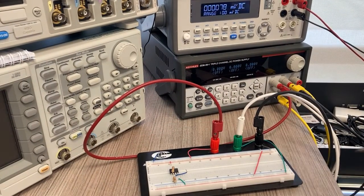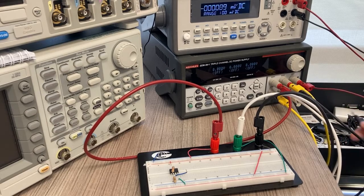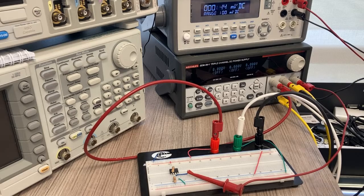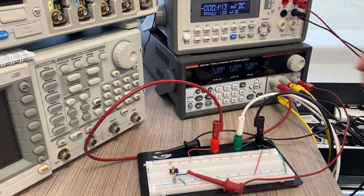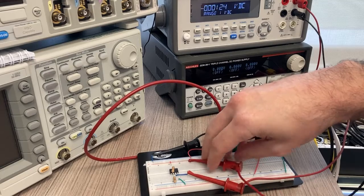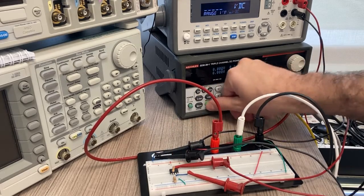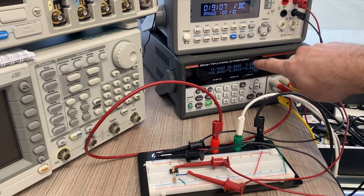For a positive signal, I have my positive connected normally. For a negative voltage I can just flip the leads. I set the common ground on the circuit to the established wire on the corner, and set the multimeter probes to the output — positive side to the output, negative to ground. Turning on the output, I'm applying 5 volts to the input signal and get an output reading.